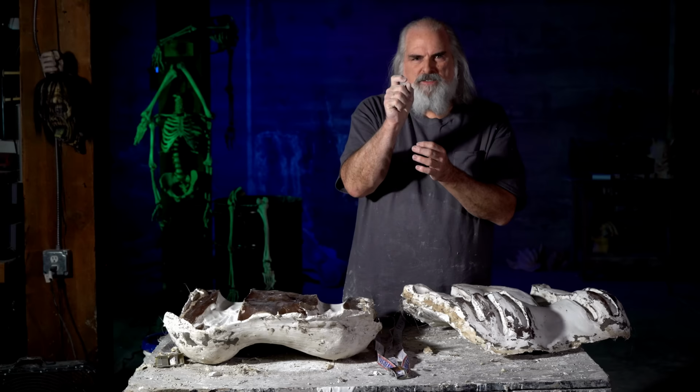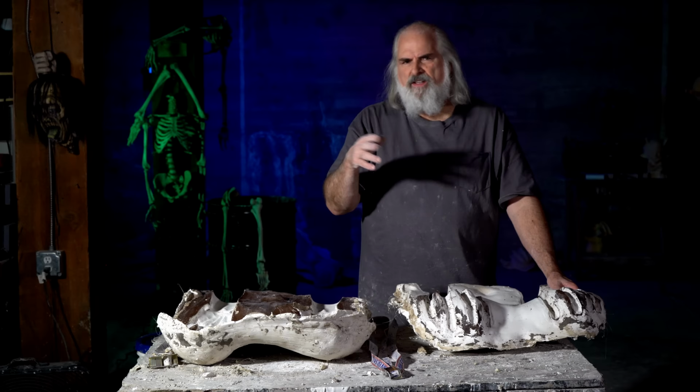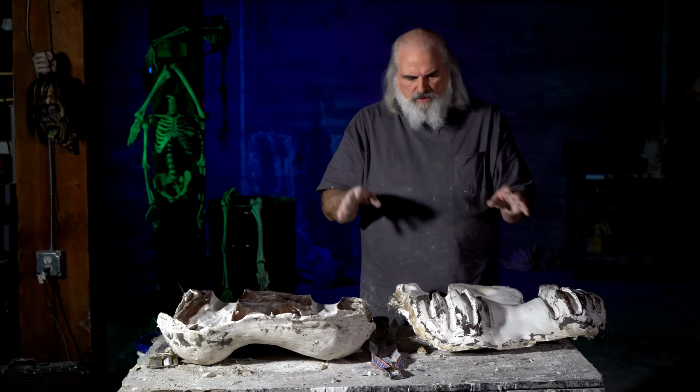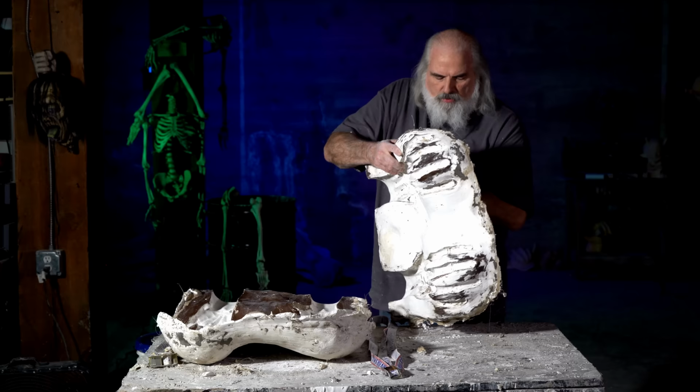Now, that happens a lot of times, and if it's not severe, you can just stick fresh clay into the crack where you see it leaking, and then just kind of stay with it a while, make sure that it's stopped. Eventually, the latex will set up and it will seal that so it won't keep doing it. But that's really important. It's a little detail, but boy, you'll suffer.